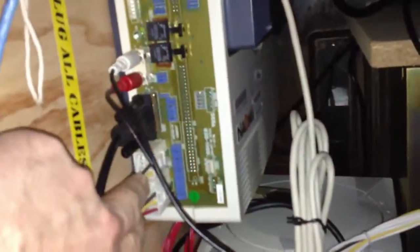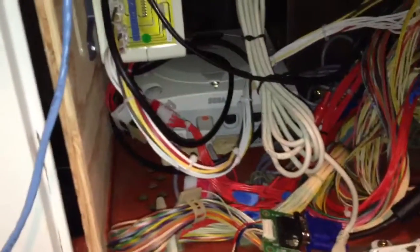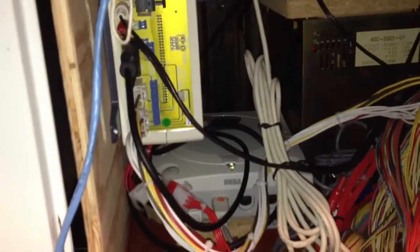Set them up here, which is where they come if you have a 001 loom, but I didn't, so I just went ahead and ordered the pins for this and the connectors for these from DigiKey. Actually, the pins on this side I think I already have, if I remember right. The other ones I ordered from DigiKey, and made my own power cable to power the NAOMI. So that's the power, and then the video I've got through the VGA cable.